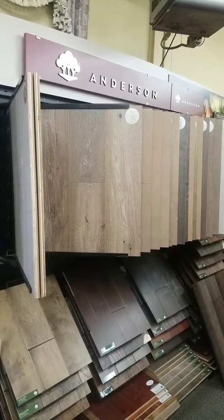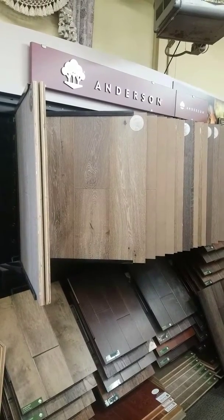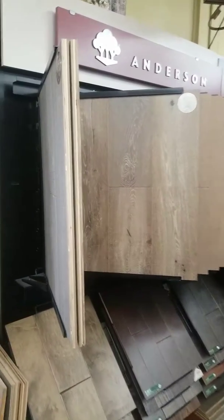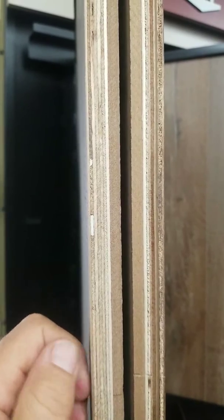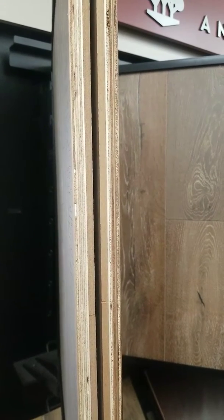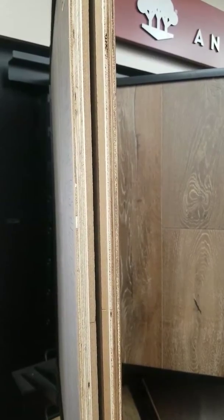First things first, there's a wide variety of different wood flooring. You have solid wood and you have engineered wood, most of which we sell is engineered wood. If you look at the side of this, you can notice it looks like plywood on the side with the top veneer right here — that portion is the actual beautiful aesthetics of the wood. The lower portion acts like plywood, so it doesn't expand and contract as much. That means we can glue it down to a concrete subfloor, and we can also staple it, nail it, or do a floating floor with it.